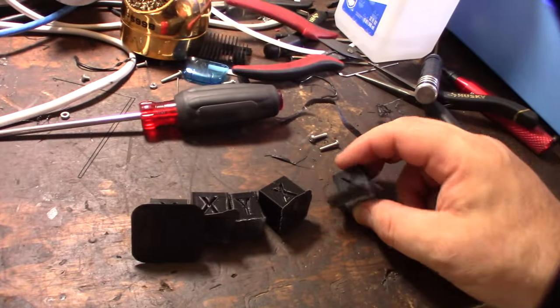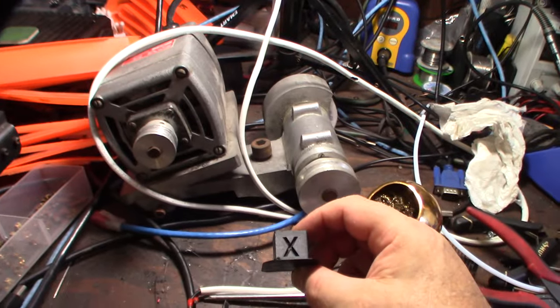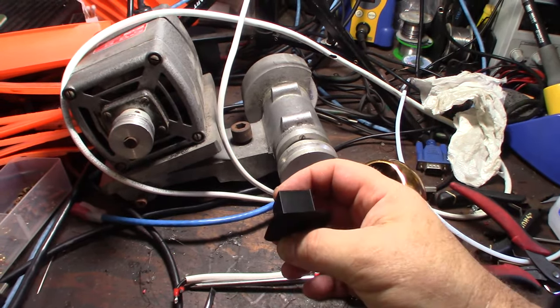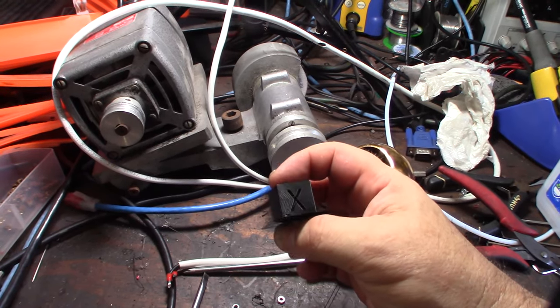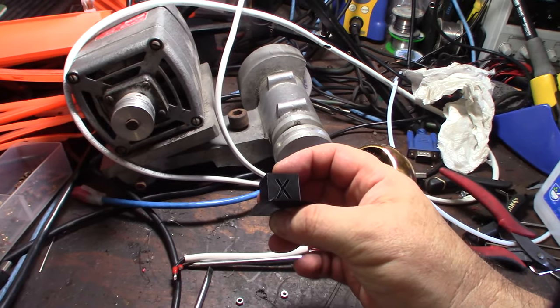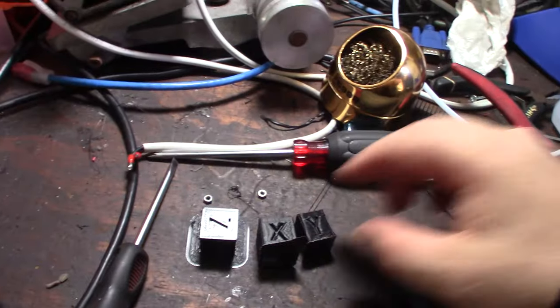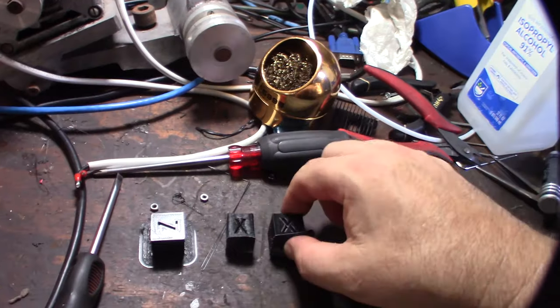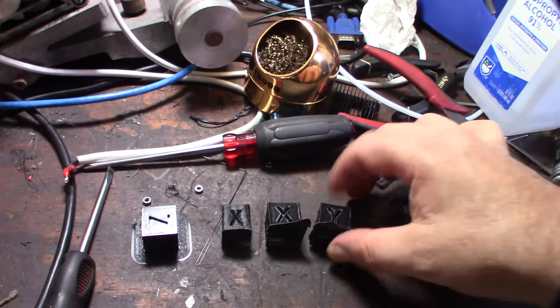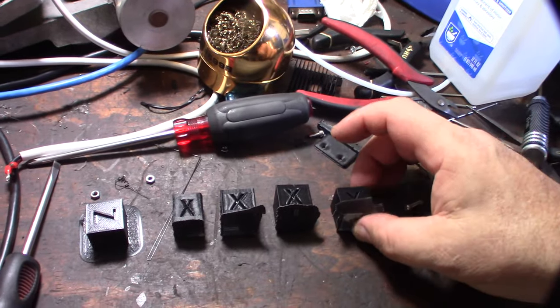I knew this printer would print well because I could tell from the PLA with the stock firmware — it's pretty good for a stock printer. Look how tight the layer lines are. There's some vibration but I haven't done any tuning. Small printers typically print better too. Here's an evolution of prints — this is when the pulleys were off, it has odd 17-tooth pulleys, so the rotational distance is actually 34. You can see the difference in cooling between them.